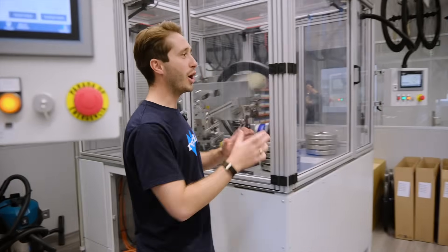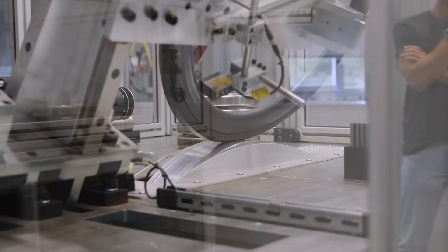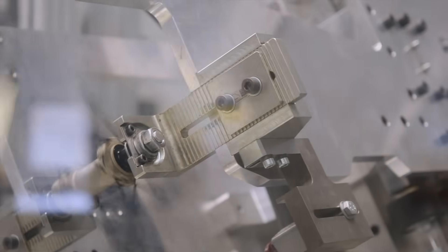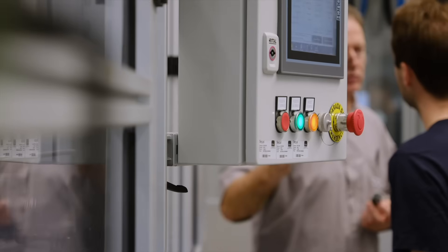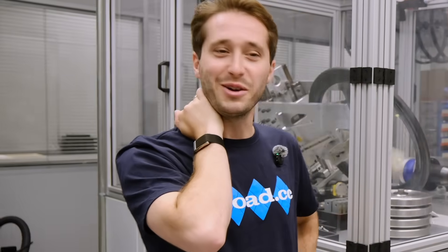Over here, I'm very reassured that I can spend my whole ride sprinting. What is this test? This is the sprint test — the objective is to check the quality of assembly of the wheel, because the tension of the spokes must be equal. How long does this test go on for? In this case, 1,000 kilometers of sprinting.